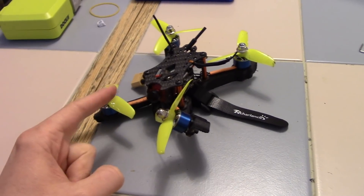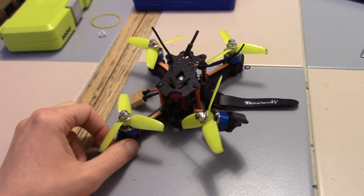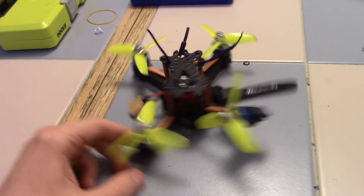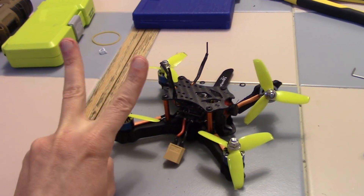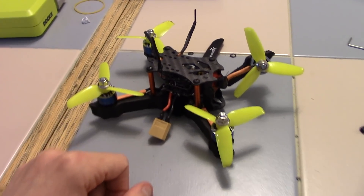It was really interesting to see how that vibration caused such chaos on this drone, and how just a simple addition — this little extra piece that comes down next to the arms to make it just a little bit stiffer — really solved all those vibrations. There's some really cool stuff going on inside these quadcopters. Look forward to exploring the project from here. Thanks for watching, guys. Have a great day. Stay awesome. Peace — Brothgar out.